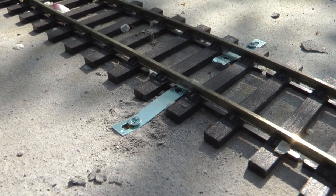I'm using this frame to explain what I have learned. Originally I thought having this oval hole at the end of the bracket was going to make a difference, but not really. Since the other end of the track is in between the rails it doesn't make a huge difference if it is just a couple of millimetres in or maybe 6 or 7. What really makes a difference is how much metal — how much of the bar — I have on the other side of the screw. For the best result the bracket should extend beyond the dip created by the drill, so that when the screw is fastened it acts as a lever and pivots around a point which is sufficiently high and not in the dip. This ensures that the bracket applies a downward force on the track. Therefore a simple metal plate of the same size with a single hole around 7 to 10 millimetres from the end would have been sufficient.